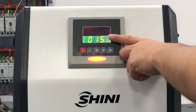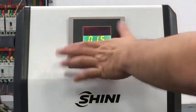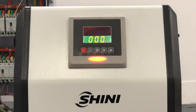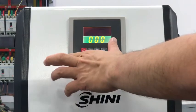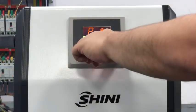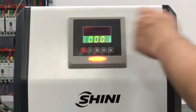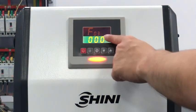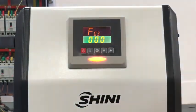Basically, the main parameters we use are: F01 — the conveying time, meaning how many times you want the machine to load material. F02 — the shut-off valve time. F03 — the regrind percentage, meaning what percentage based on the conveying time.